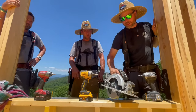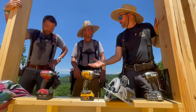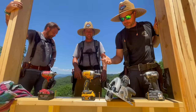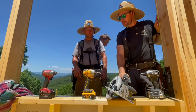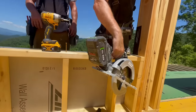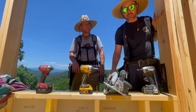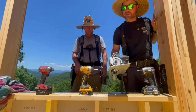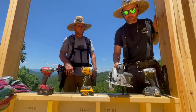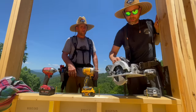We've had a lot of people asking about the Flex tools and what we think about them, so we've used them for about a month now. The circular saw comes with an 8 amp hour battery, and this thing feels like a corded saw when it has a charged battery — it will pretty much blast through anything, but it is heavy. It's heavier than our DeWalt, heavier than the Makita. But if you just want power, it does go a long time on the 8 amp hour battery. I do need to adjust the base, which has adjustments — I think it came from the factory slightly out of square to the blade, like one degree maybe, and I noticed that cutting posts.